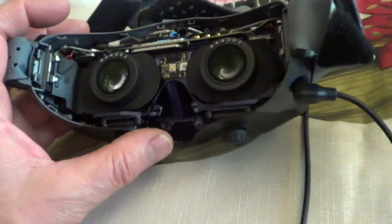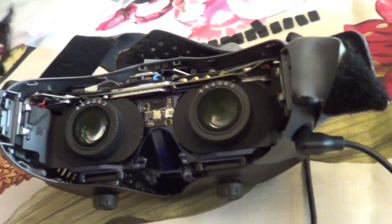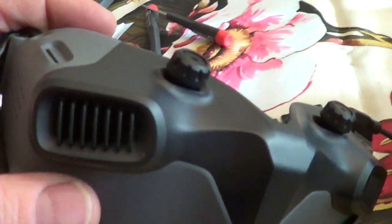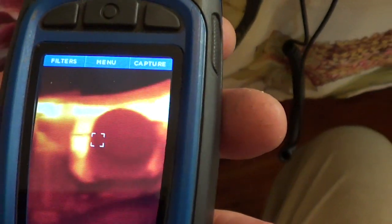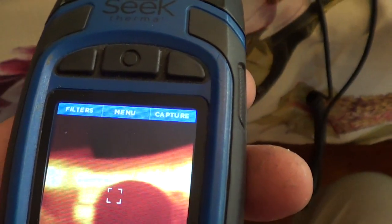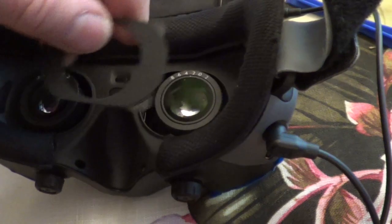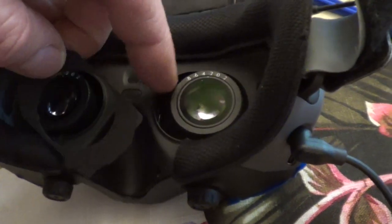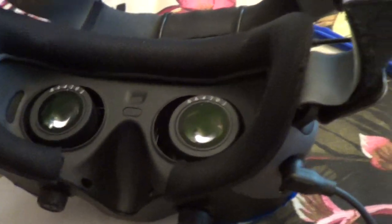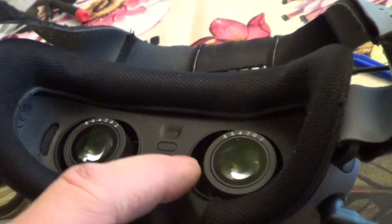I want to show why these Goggles 2 fog so badly. There's very little airflow right where my finger is going over the eyeballs, and most of the air is sucked in through the front. Using a thermal camera, you can see where the heat is — there's not much heat at the bottom near the OLEDs, but quite a bit at the top. Putting holes around the top will get airflow right over that board. A quick and dirty fix is to leave the rubber guards out, but I want air to travel all the way across my face.